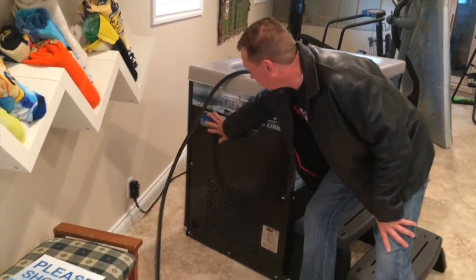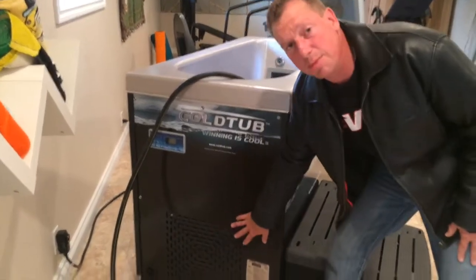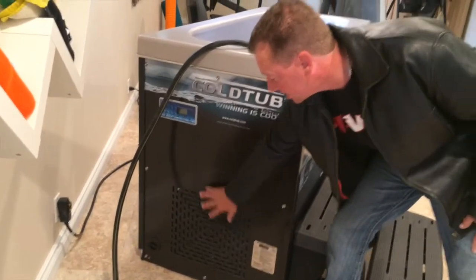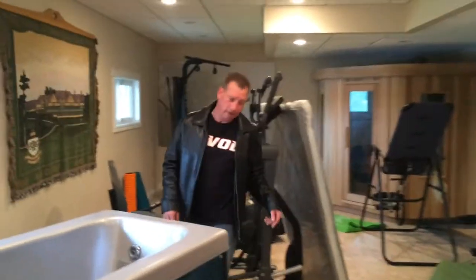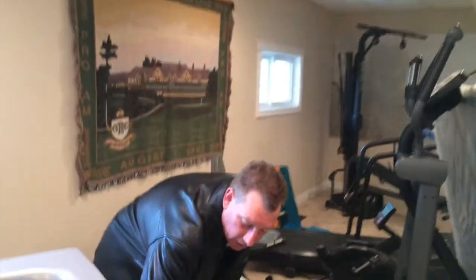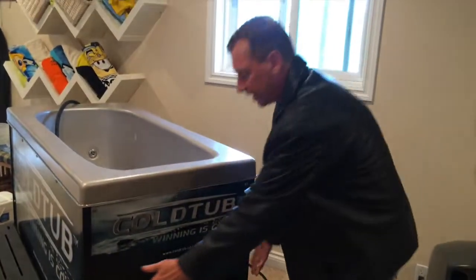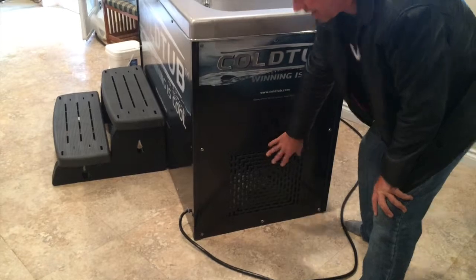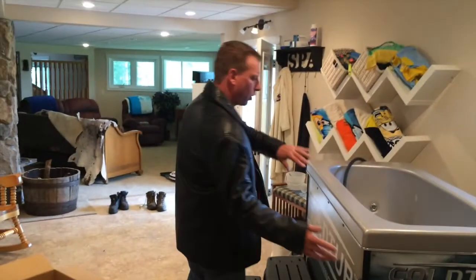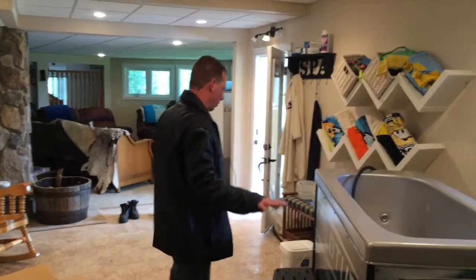This side with the control panel — very important. Your chiller is right inside of this grill. We need air movement access to this side for this grill. And on the far side, down here is another grill — that's your air inlet. Air is going to come in one side and out the other side. This cannot be blocked off and tucked into a wall. We need air to run through there to run the chiller properly.